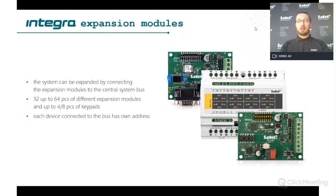You can place the main security panel on the first floor and put additional boxes with zone and output expanders on each floor, reducing the amount of cabling across the building. Between the main panel and an expander, you use just one four-core cable for the bus, and you can use a local power supply.